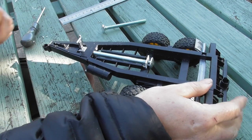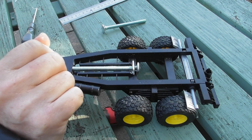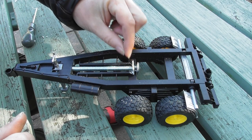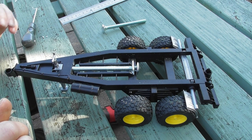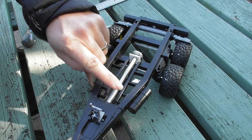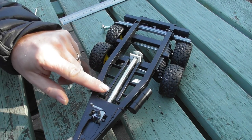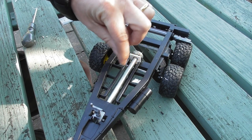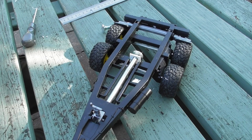Now the other thing which I did was I remade my little bracket here, and that was because the 6mm which I initially drilled from the base wasn't quite enough, and the nut was lifting up as it came back. So I re-drilled this one at something closer to 5mm, and actually the nut sits much flatter as it's going up and down. You need, as far as possible, to at least have the bolt being horizontally parallel to the chassis as it goes along, so that there's a nice smooth movement, and also left to right. You need to make sure that there's enough space on both sides for the nut to pass up and down easily. So having got that sorted, I was kind of happy with that.